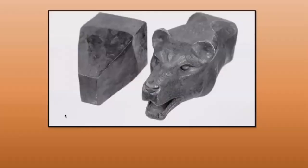If your proportions are off now, it's not going to get any better if you go on. So fix any proportion problems now. And I don't care if that means going to your belt sander and grinding the nose off a little bit or cutting it off with a hot cut, whatever it is, but make it right. If you've drawn it out too long and weedy, you're going to make more of a wolf than you're going to make a bear's head. And if it's too short, it's going to look like a bat or a little piglet rather than a bear's head.